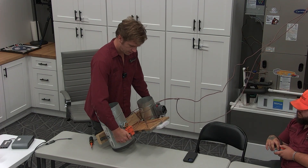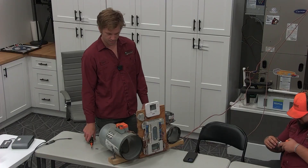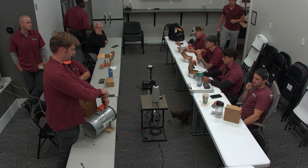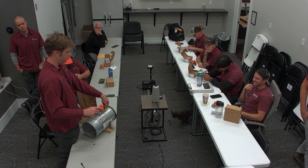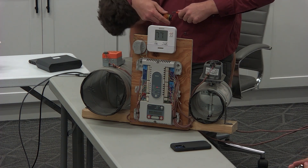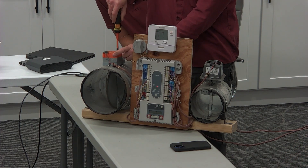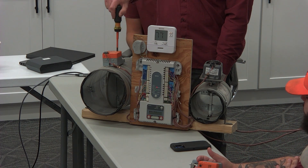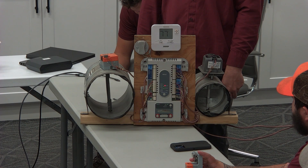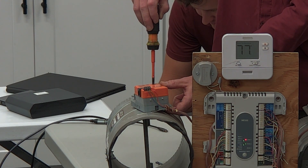So here's the brace — you see the brace on here? That holds the back of your motor in place. If that's not on there and your motor turns, what will happen? The motor itself will spin. When it comes on, the motor turns, which we don't want. So that brace is crucial. It comes in your box. It's easy to have it fall out in the attic and not realize it's there if you've never done these before. That's how slowly they turn, by the way — that preserves the motor long-term. If it's not supported, the motor turns instead of the shaft.